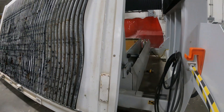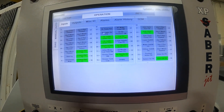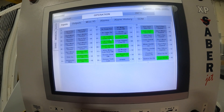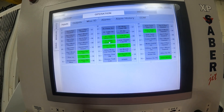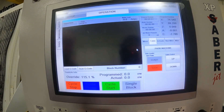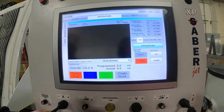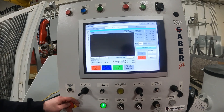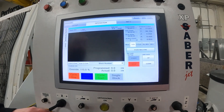We're going to double check our inputs here. Now that we're back at the screen, we can see that our table up prox is not lit up anymore, and our table down prox one is lit up and prox two is lit up. So now, once you make sure you have that, we'll come back to our auto screen and I'm going to hit Park Machine. I am going to hold my hand over the e-stop just in case, because that table is up. But the machine should just park here. You can see our position moved and our machine parked.